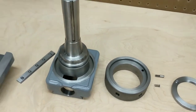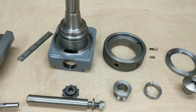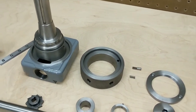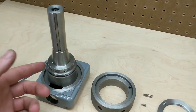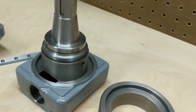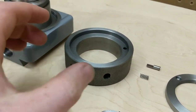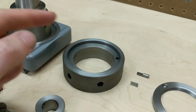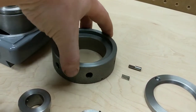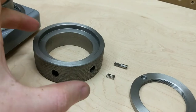The next thing I did differently: this whole thing is actually intended just to be used on a lathe, threaded onto an inch and a half, eight spindle thread. I never intended to use it on my lathe and I don't have that size lathe anymore — I have a bigger one. So I made this R8 arbor for it to go in my milling machine. It has an inch and a half, eight thread on the bottom and it's threaded in and then pinned all the way through with spring pins so it can't come out. And on the collar, I added holes all the way around so you could stick a shaft in there and hold it instead of grabbing it with your hands.